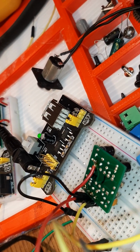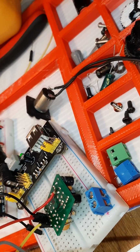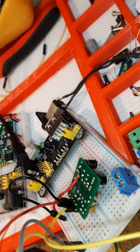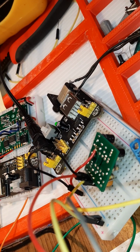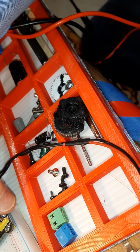And then I come over here and I touch the switch and I can get the pulsing that I would expect to get through the toggling of the sensor. So this means my puffer board can be triggered to run on 5 volts. That simplifies a lot of things.